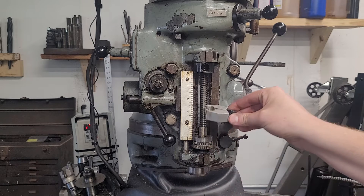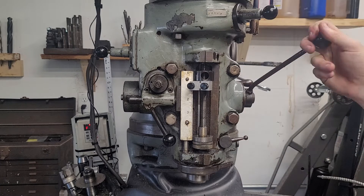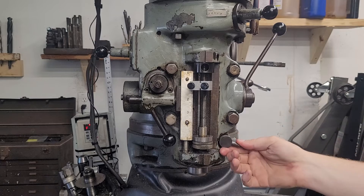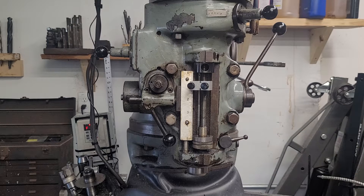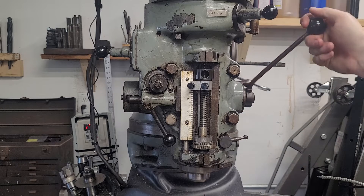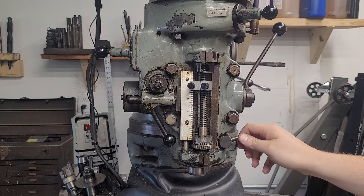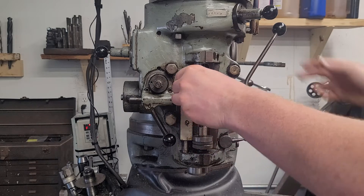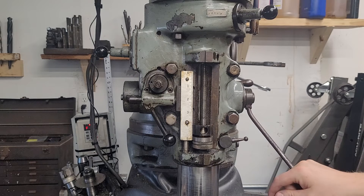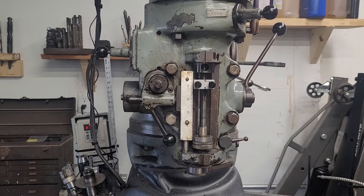These are also a really nice little eight or ten dollar gadget. And the last thing — this is pretty important if you're milling — this is your quill lock. You want to lock this so it can't go anywhere. What will happen if you don't when you're using an end mill is it will just slowly suck the quill down. I like to have the quill as far up as is reasonably possible when milling — it's much more rigid. When you have the quill out, it's almost night and day how much more flexible the machine feels compared to being all the way up.